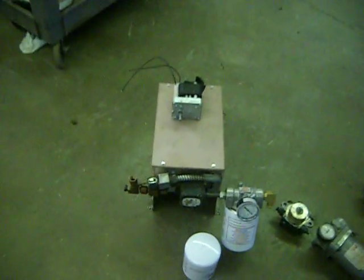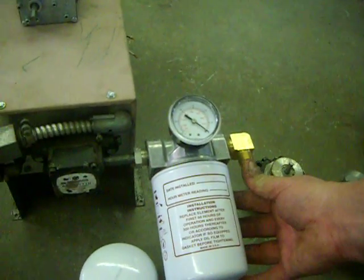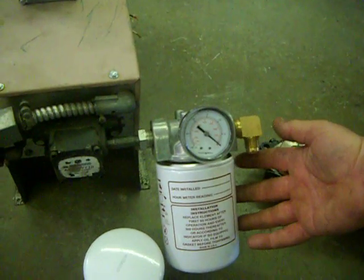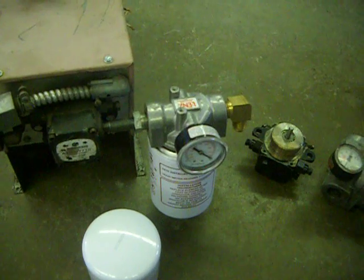The meter pump needs to have a leak-proof suction line. We recommend a flare copper suction line. It goes off of the meter pump, down the tank, and is cut off 10 inches off the bottom.